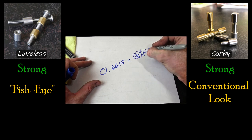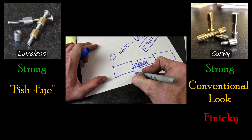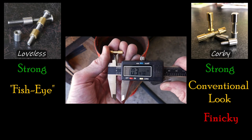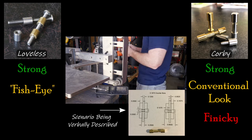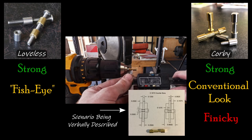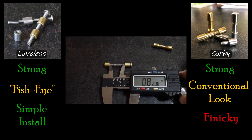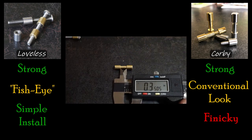I personally love Corby fasteners, however they can be finicky depending on the width of your handle scales and blade material. The Corby fasteners may need to be adjusted in length to work properly. For instance, if you're using quarter-inch handle scales with an eighth-inch blade steel, you may need to shorten a new Corby fastener so that the head-to-head distance is around a quarter inch, assuming your counterbore is around three-sixteenths of an inch deep. With Loveless fasteners, this attention to detail in length is a non-issue — they have a large operating range solely dependent on the length of the bolt itself.